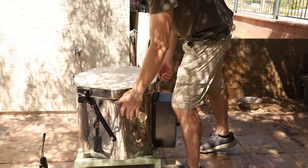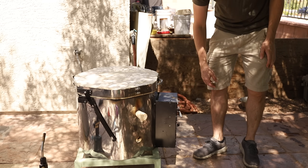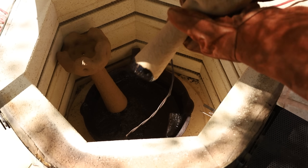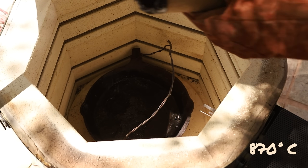Next it's into the kiln to burn away the plastic and turn the shells into a strong ceramic. I don't just burn away all the plastic though — once the temperature is high enough for it to liquefy, I remove most of it, and then I return the shells to the kiln and fire them at about 1600 degrees Fahrenheit.